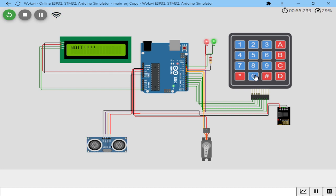The keypad allows you to enter your phone number. The microcontroller displays your phone number on the LCD screen. It also sends the phone number. As you can see, it has told me to enter the phone number. You can key in any phone number, your phone number, as long as it's Mpesa enabled. And the ESP8266 sends the phone number onto your website.